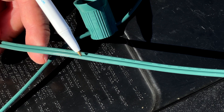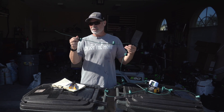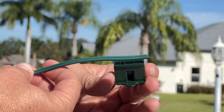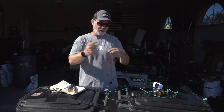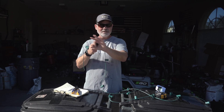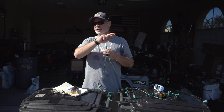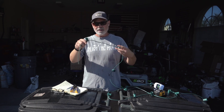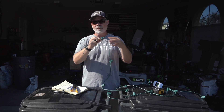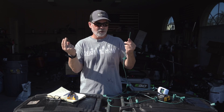The good news is with modern LEDs you do not have to worry about polarity. You can put the plug on this way or that way; with inline vampire plugs it doesn't matter either. I can't guarantee that for everyone else's LEDs, but the ones we sell on our website — I've double and triple checked with our supplier — with this wire you do not have to worry about polarity. Put your plugs on whatever way is most comfortable and you're good to go.